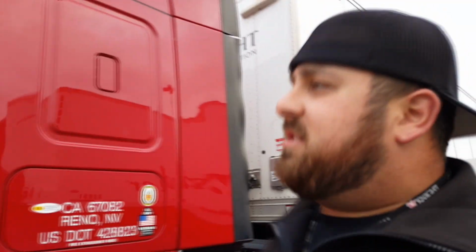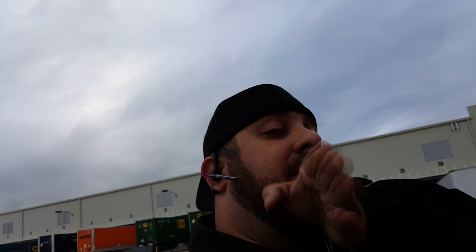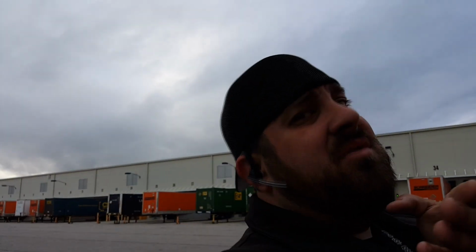All right, shut the truck off for a second, put the brakes on. Shut the truck off, I want you to hear me. All right, what he did there was called ringing the bell. What he did was, when the fifth wheel and the kingpin were coming together, it wasn't perfectly centered. That's why when the trailer moved like this and he hit the gas pedal, or the throttle, some people call it, it went and did that number.